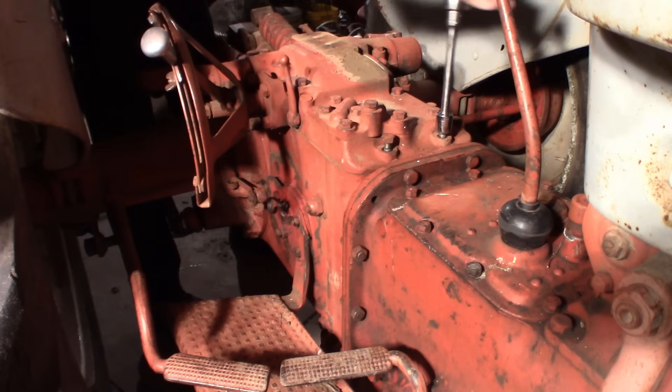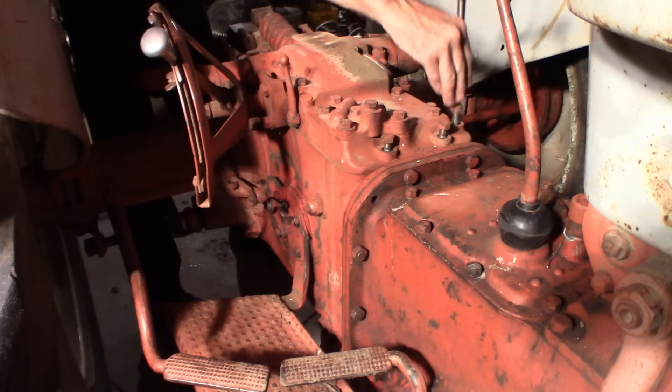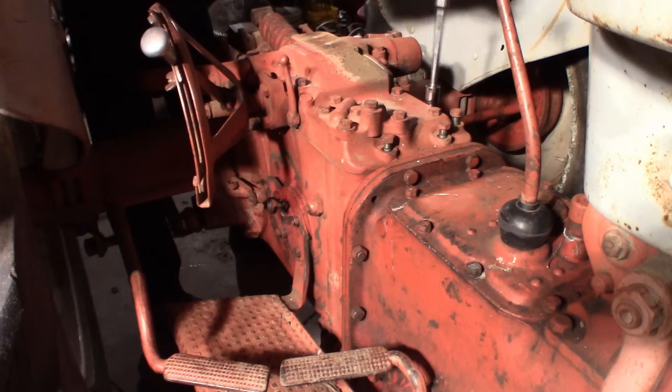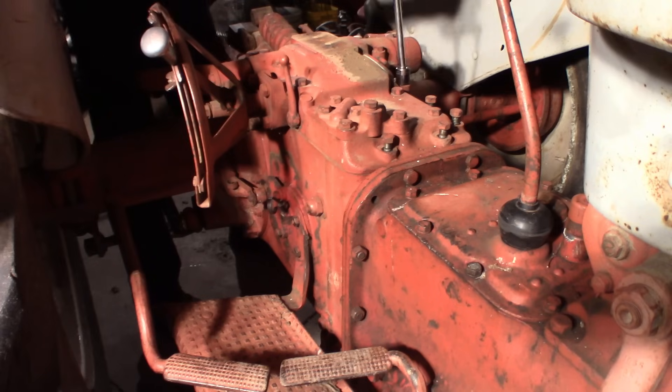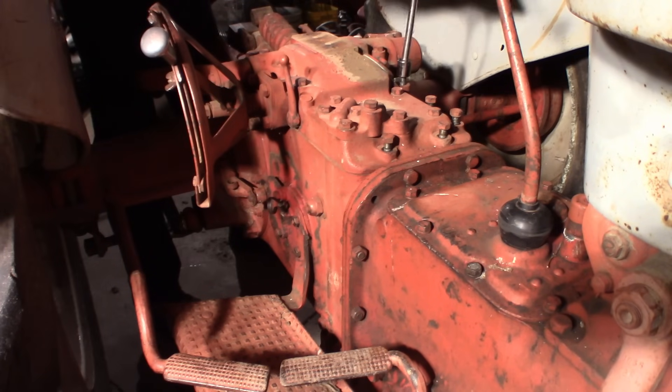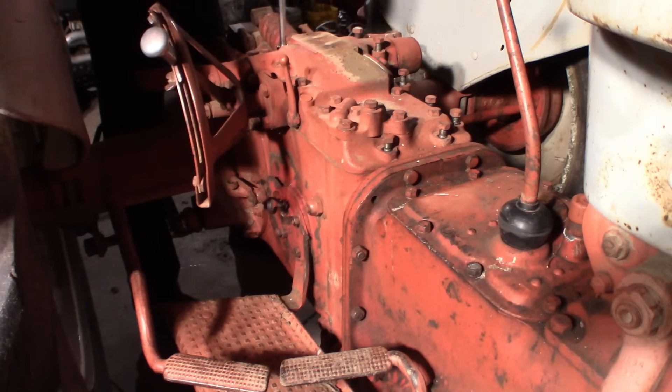It's a real little bear to try and get that yoke off that T. Now the 8N, they improved it a little bit — instead of having the yoke, there's just a rod that goes down and that rod kind of goes into a little pocket instead of that T-shaped bar. For the 8N you just have to lift it off, but to get it back together you have to have that cover off so you can guide the end of that rod down into that little pocket. When I lift this cover off, all the hydraulics, controls and everything, are going to be attached right to this cover and there's nothing to catch or give me any issues.